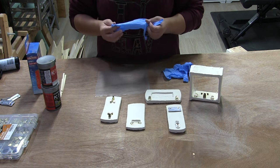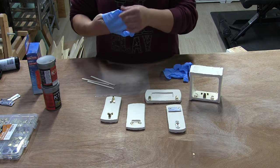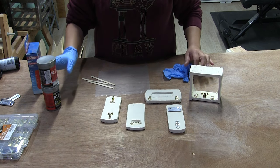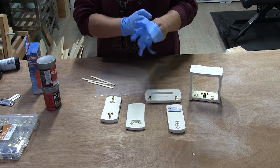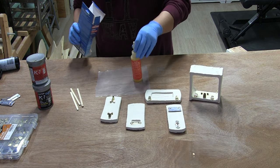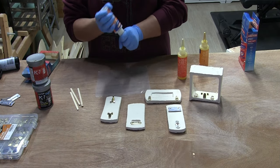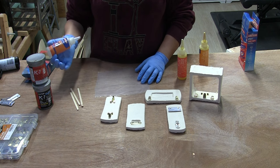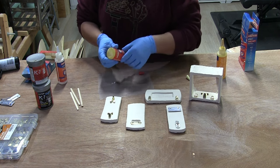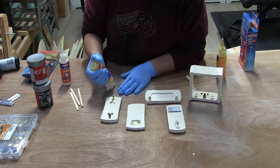Because these are chemical reaction type adhesives, you'd be better off mixing them on something disposable — a piece of plastic, a paper plate, something you can throw away. I recommend something flat so you can eyeball equal measurements of each part before mixing. For the PC7, I use a separate stick for each color to avoid cross-contamination. My Loctite epoxy comes in droppers — this one has hardened unfortunately. I'll use what's still good and just pick a couple of things to glue with epoxy and a couple to glue with PC7.